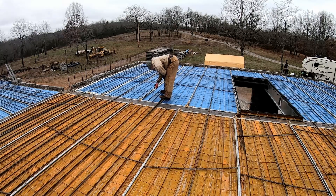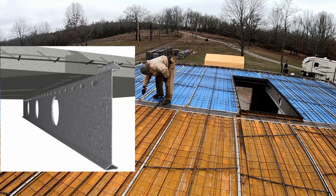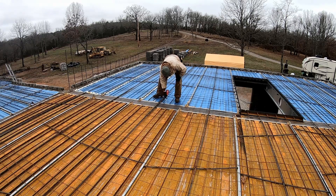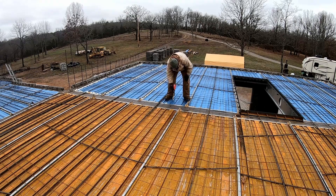We determined that some of these cracks would probably be easier to fill from the top, and it was easier to put the foam in, but the work actually ended up being harder. The way that these speed floor joists work, there is an S-section on the top cord that gets locked into the concrete, and that's what provides a portion of its structural load-bearing capacity. What we figured out, looking at the foam along that edge after it dried, is that it was going to create a big void around that S-section that needed to be locked in the concrete. So we had to come back after it dried and cut all of that away so that just the small portion in the gap remained, and that entire section of the joist was in contact with the concrete.